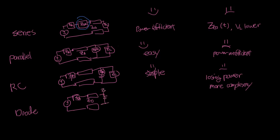And then the other clever approach that we talked about was that you put a little couple set of diodes, this one going up to your rail voltage at the load. And so what that does is it ends up capping your voltage, and so even though you might have a reflection, it puts an upper limit to the size of that reflection.